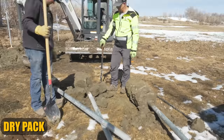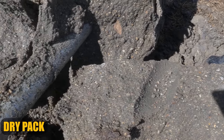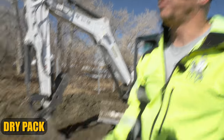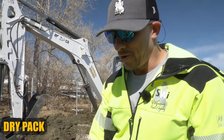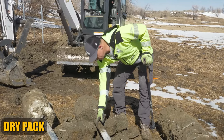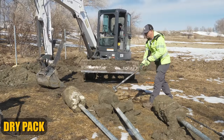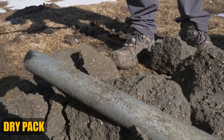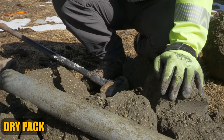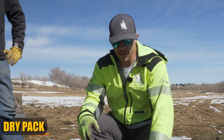It's about what I would expect. You can see it just looks more granulated. I would not call it soft — I've seen softer concrete. I think the way to get even weaker concrete is if you mix it too wet. It was frozen to about right here, so we'll see if the bottom half comes off easier. There we go — just cracked it. I didn't notice any difference between the top and the bottom. I noticed a hollow sound — it wasn't solid, it wasn't ringing, not as firm or solid, and definitely lower PSI.